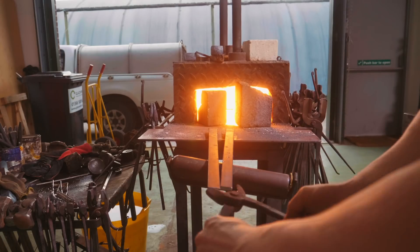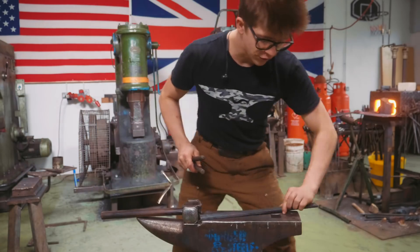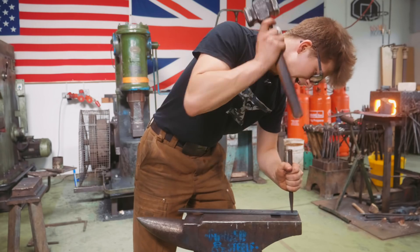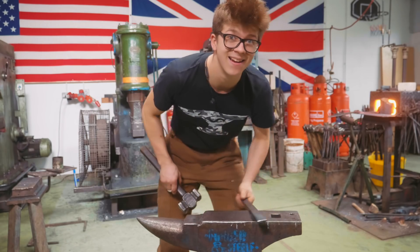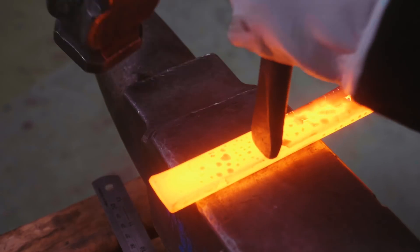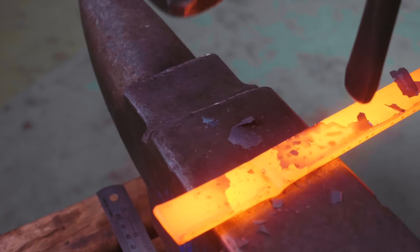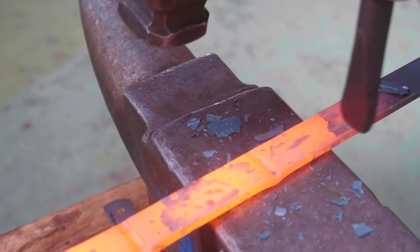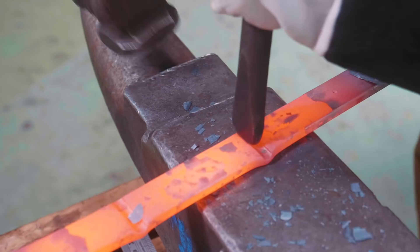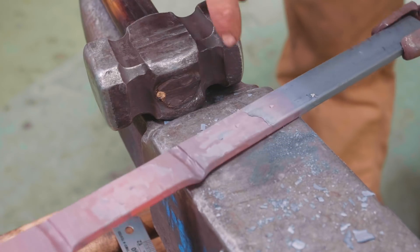Now I'm going to need tongs to hold it. Let's have a look and see if I got anything — first try, great! And so, into the fire we go. And since we have just a few seconds, I'll use this opportunity to lay out the helmet hook, remembering the measurements from the other time: fuller mark, fuller mark, punch, punch, chisel. These pieces are hot, let's start forging. Those fuller marks show up nice and clearly at these temperatures, so I'll start working side to side — middle, side to side, middle. The reason I'm going side to side is when we're trying to move material, we want as little resistance as possible. We can reduce resistance by reducing our surface area, so by going side to side we're creating little notches there, which means we do more with each blow.